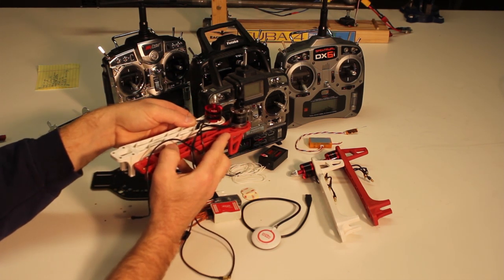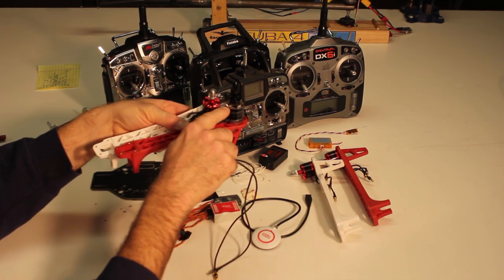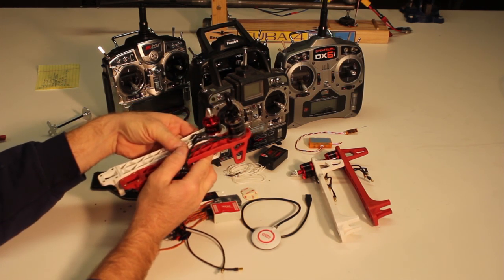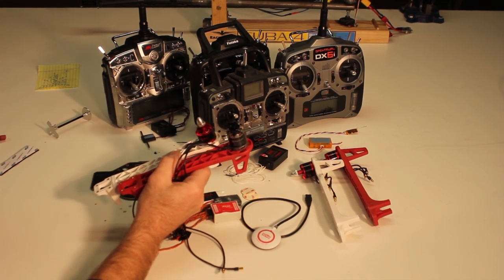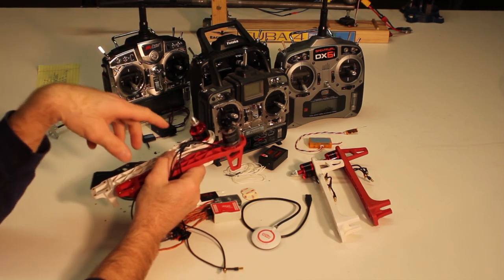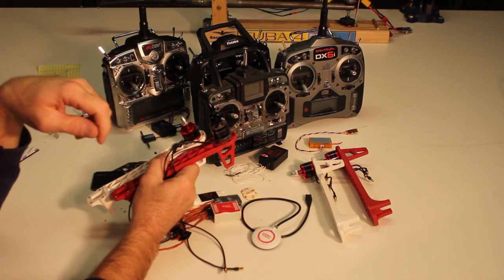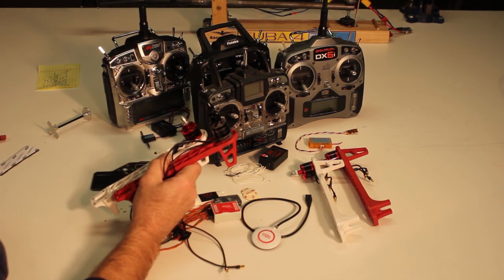You can see one motor is a little taller than the other — that means a little more stator. The stator is the inside of the motor; more stator means a little more power. I know I'm going to run 10-inch props on my helicopter and I want enough lift to carry two battery packs, so I have redundancy and more runtime. My helicopter will ultimately have these motors, 10-inch props, hopefully two 4-cell battery packs, and a GoPro with a video transmitter — so I can fly it around FPV, nothing long distance, just around the field or park.